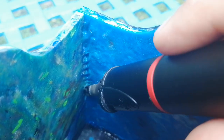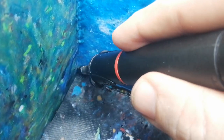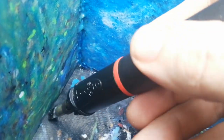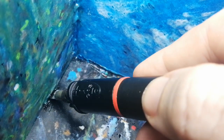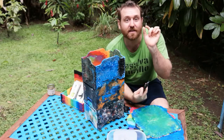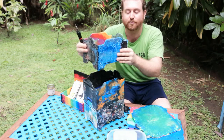You can take that and literally just go along the seams of your boxes and weld them straight up. If you want a little more sturdiness, you can actually feed in a little bit of that 3D printer filament while you're heating up and melting that seam — and you can have a really thick, strongly welded joint.